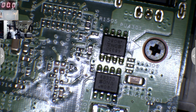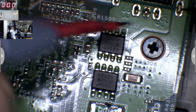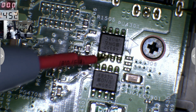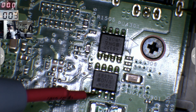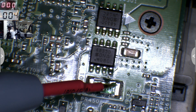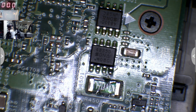Let's check with the multimeter. On the multimeter — if I touch the face you see zero. Let's take ground, then touch the plus: not short. The first chip is not short. Let's go to the second chip — here it IS short to ground. So the short to ground is after the two protection chips, somewhere further in the laptop.